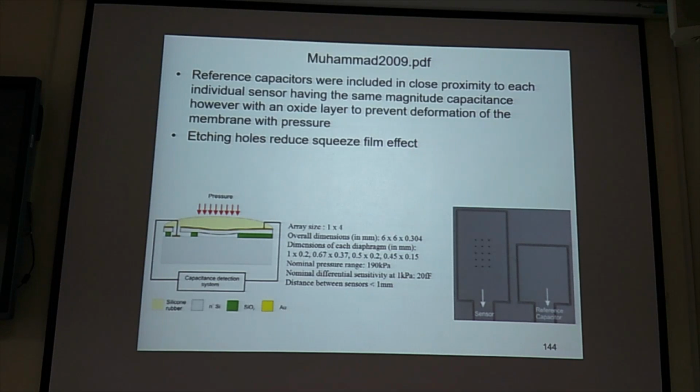I'm confused. The SHLD is the zero voltage, so it's the same as the GND? No, it's not ground. Ground and shield are different. Ground is ground. Shield is a square wave excitation signal. You will drive CE plus, CE minus, and the shield.